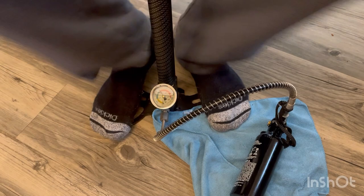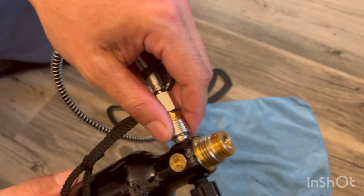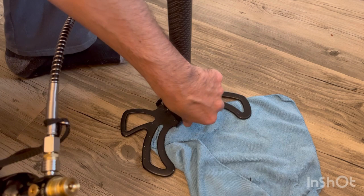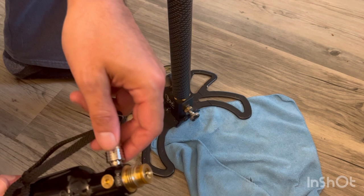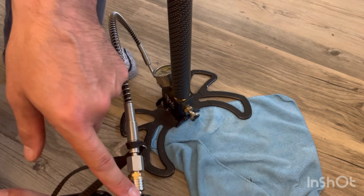All right, once your bottle is full and you're satisfied, you cannot release this Foster fitting until you bleed the pressure. Even if you did and were able to release this, it's under tremendous pressure and you were to manhandle it off there, the check ball should close your tank. So it won't be a rocketing projectile, but this hose is gonna come off like a cracked whip.